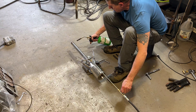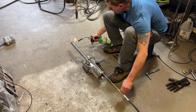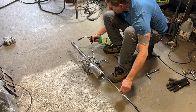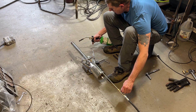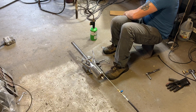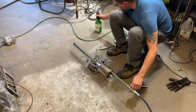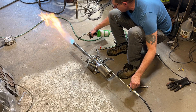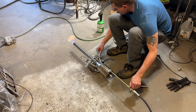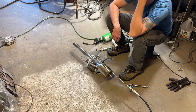I end up moving the spuds back to try to get a little more air pulled in through the air horns, because those air horns are basically ejector pumps that pump air using the velocity of the propane. The more propane velocity you have, the more air those ejector pumps will pull into the combustion zone. I'm using a one-eighth inch nominal size stainless steel tube, so the inner orifice is about three millimeters. I also tried injecting compressed air to force the air-to-fuel ratio to change, but I just can't get it dialed in right.